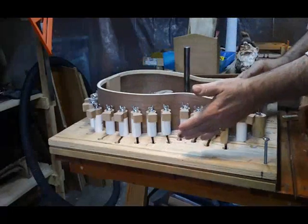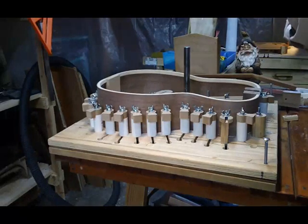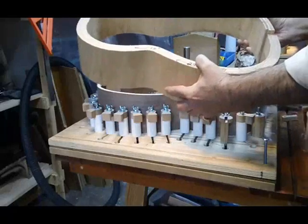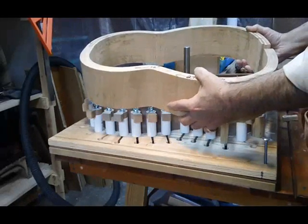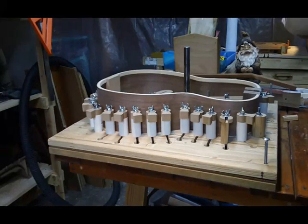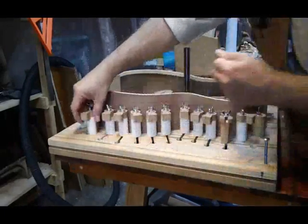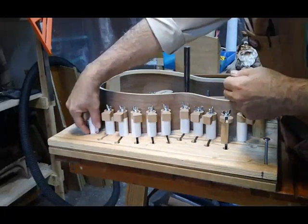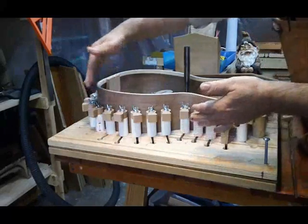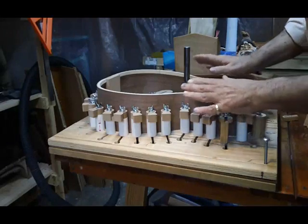The Mega Mold has many other uses. Particularly, one does not have to purchase or make an outside mold, which is a fine way of building but is limited to that one shape. You do need an extra mold, either purchased or made, for each style of guitar you want to build. That's an excellent way to do it, but not as handy as the Mega Mold, where by moving a series of rods in and out you can make any outline you want, customize it, or copy an outline. Just the one mold will do that.